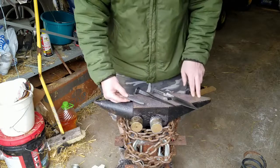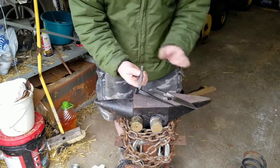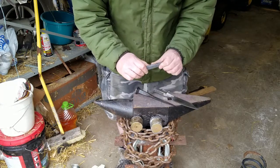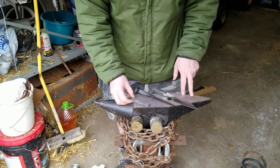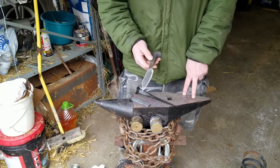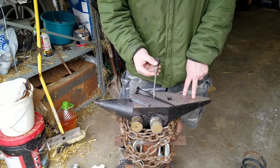You see this piece of coil spring here — it's not overly brittle. I've dropped it on the floor and it doesn't break, but I put it in the vise and try to bend it. I mean, it's about a quarter of an inch thick, and it seems pretty stout — I can't bend it. Which bodes well for this having a good edge, and this coil spring actually being worthwhile to put in there. So what I'm going to do next is do the heat treat, re-grind, resharpen and finalize this knife. Hopefully it will be of some use.